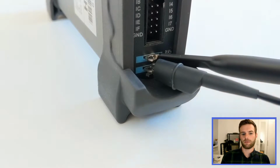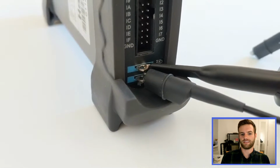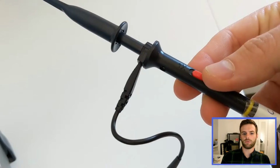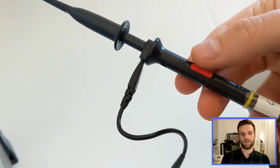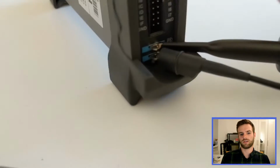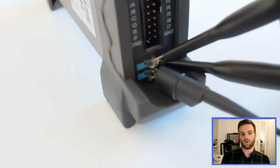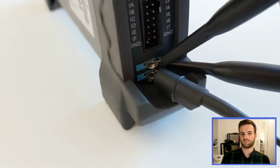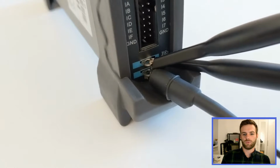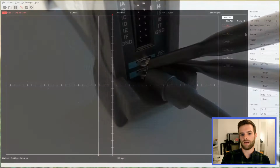The probes can be set up for reading high voltages with a magnification slider located at the handle. If we set the position to ×10, we will have to multiply our readings ×10. Therefore, we will be attenuating our measurements voltage. That is, for a 1 voltage difference, the probe will read 0.1 voltage. This allows us to measure higher voltages, and for the calibration we want to have the maximum resolution, so we leave the slider at ×1.